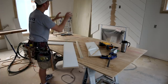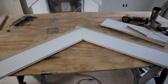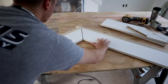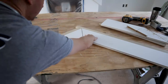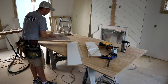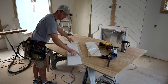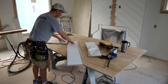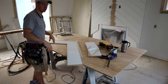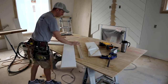Those 1x2s give me my exact angle as I pre-assemble pieces — it keeps everything the same. I get my pieces in position where I want them, pull one piece back, take my Hyper Glue, glue one edge, then stick it in place. As I push it together I'm also pushing it up against my 1x2 fence. I assemble the miter, then just take the pieces and put them on the wall. They were all the same — I didn't have any issues by simply making this jig with 1x2 nailed on plywood.